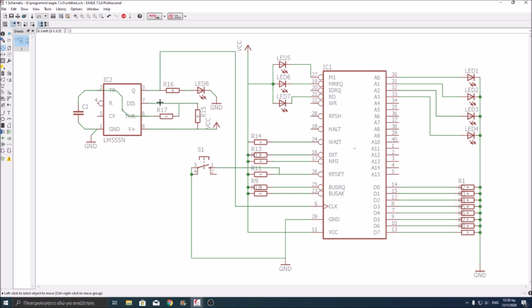It is better to connect a potentiometer here with the wiper at pin 6, the left side of the potentiometer at pin 7, and the right side at pin 8. I didn't have any potentiometer, so I did it with resistors. So now let's talk about why the LEDs are flashing that way.